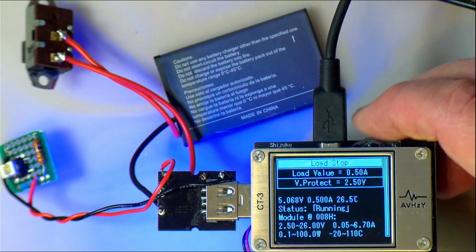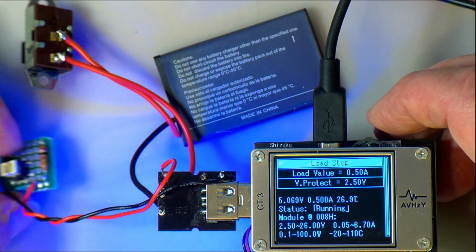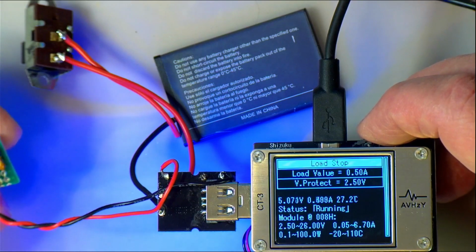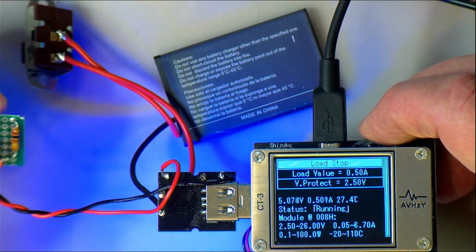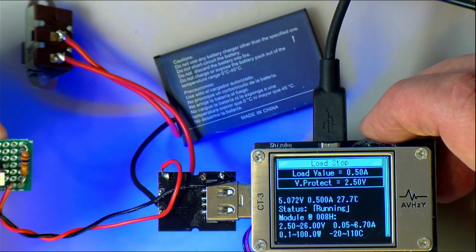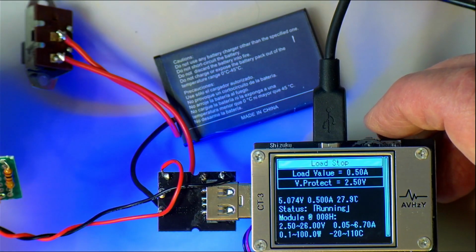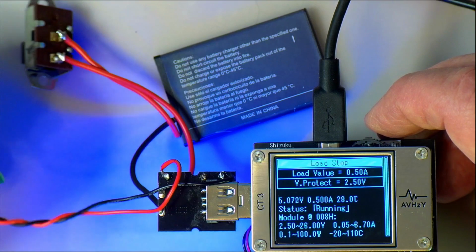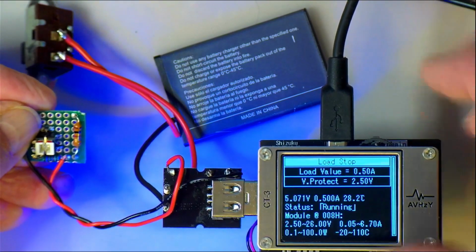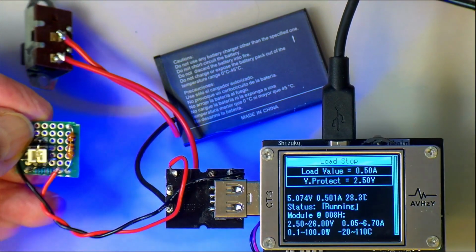And now it is able to do it. So again, what is this thing useful for? As I said, it's on a little power bank where you can put a switch on it and a little LED. There is actually a little LED in the switch, and it is wired in, but it's not lighting up because the voltage on that thing is too low, with the 100 ohm resistor on there. On here, there's a little yellow LED in there, and the voltage is not high enough.